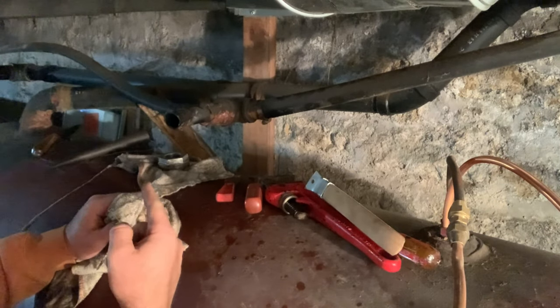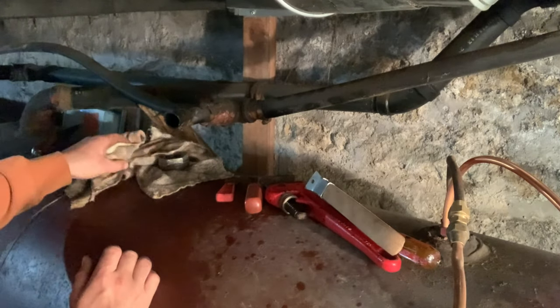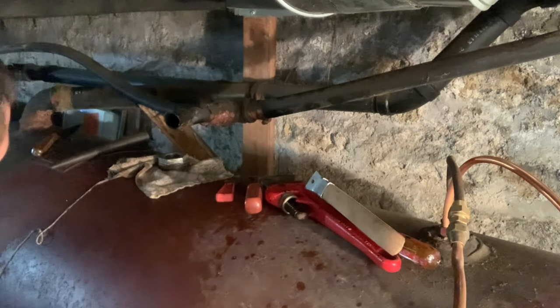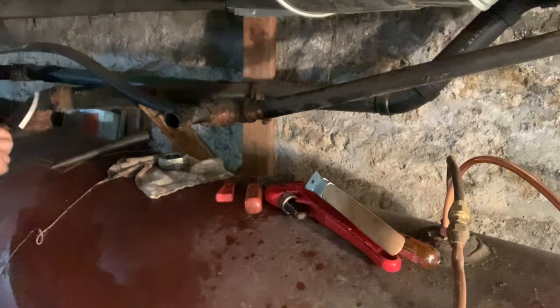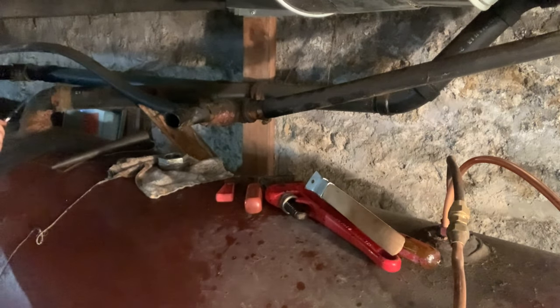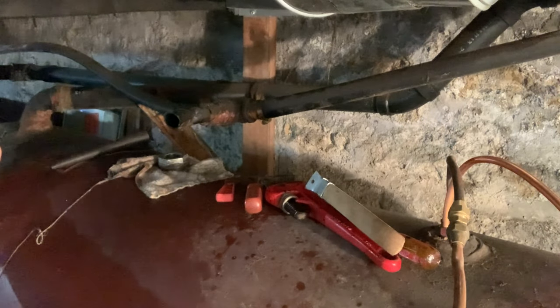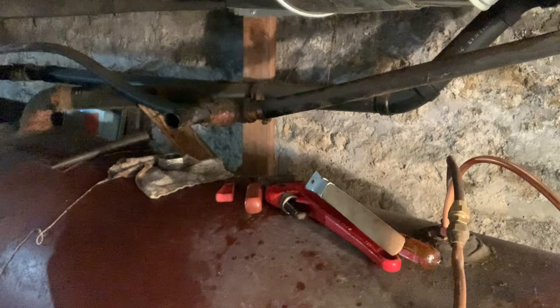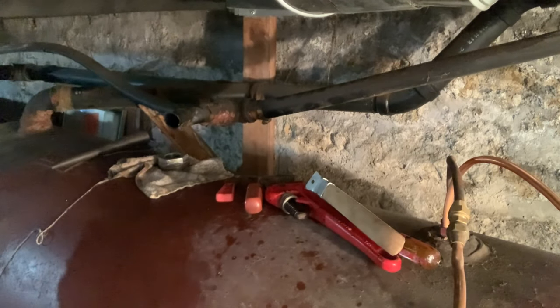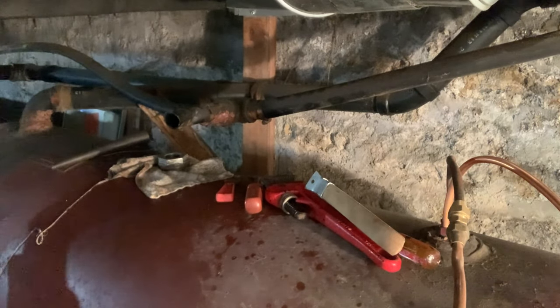Now we're going to go down here to the next fitting. And somebody really did this heater wrong. I don't know if you guys can see that or not, but they have a plastic that's illegal, an ABS plastic. That's what the black plastic is called. It's a 90 going in here, and there's a lot of silicone pipe dope looking paste around it that's hardened. So we're going to clean that off and see what's underneath there. Hopefully they didn't JB Weld it and hurt the threads at all.